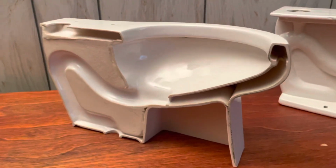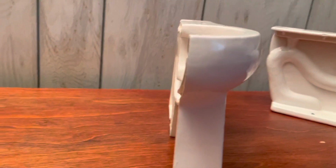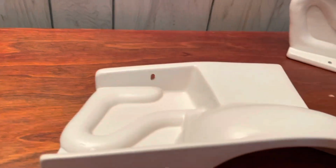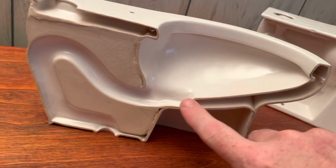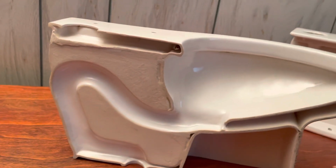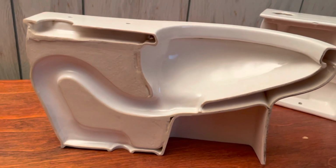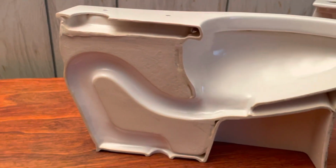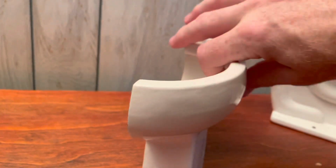And what I figured that I would do, because this didn't perfectly come out straight, like perfectly flat on this surface, is put a thin layer of Lexan or plexiglass down, and then pour over that this tabletop epoxy resin stuff, which is really great. It ends up being super clear and super tough. And then I'm going to lay this down in it to where it'll essentially meet up with the surface of this with these edges. And there will be some overlap, but I don't think it'll make too much of a difference. And then what it will do is adhere to the clear Lexan or plexiglass and be just like one solid surface. And then what I'll do is go by and cut the excess off around the edges so that it perfectly fits this. And I think that'll be pretty cool.